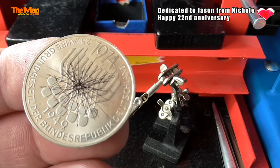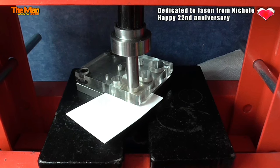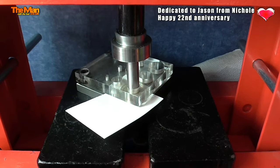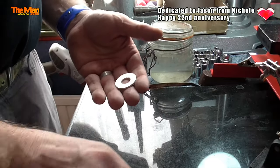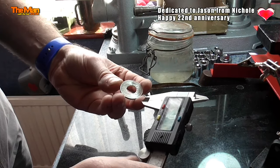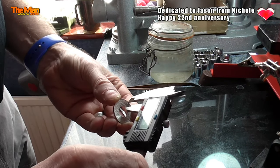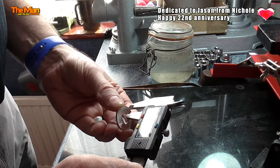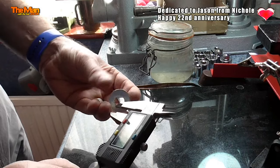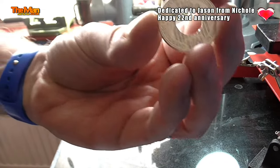What we're going to do now is make a hole in the middle. I'm going to punch the middle of that coin out. There we go — that's the hole in the middle. I'd like to just check and see how close I was to getting that dead centre, because it is done by eye. That's 8.20 millimetres, 8.26 millimetres, 8.27 millimetres, and 8.20 millimetres. That's pretty good. I'm happy with that.